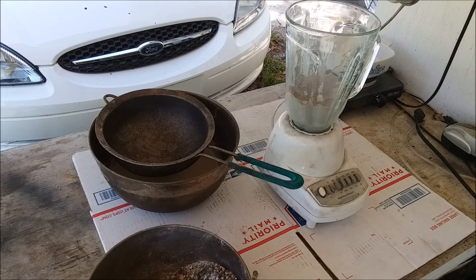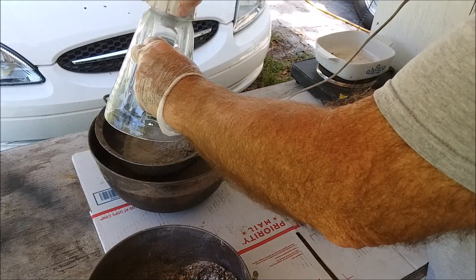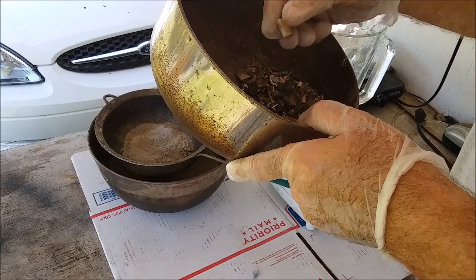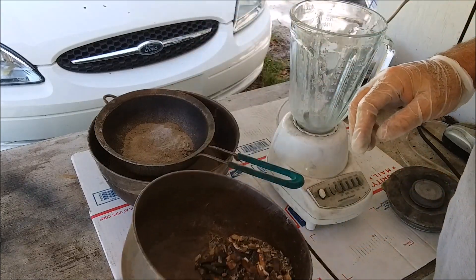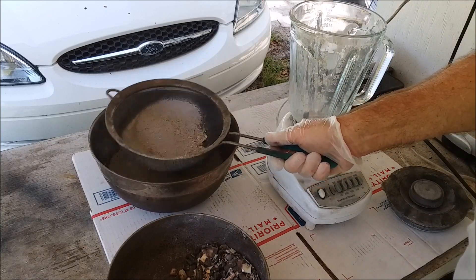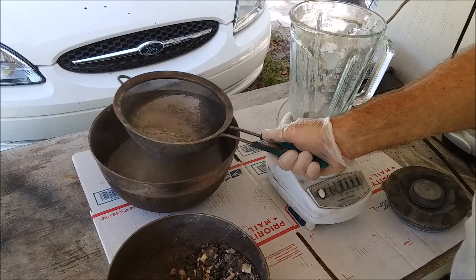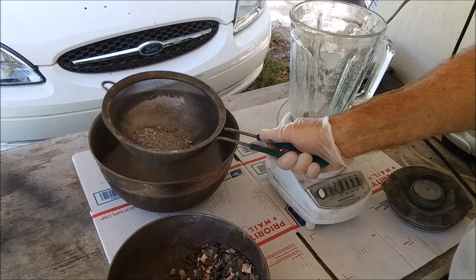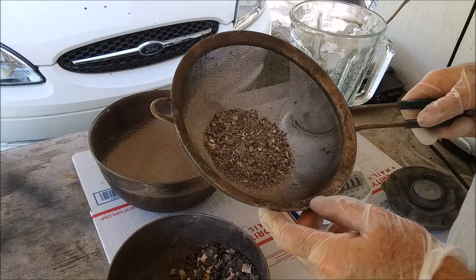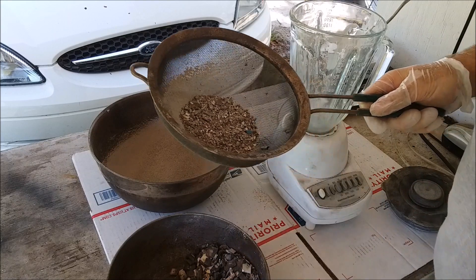Probably don't want to breathe that dust. Some chips you will find have a surprising amount of metal inside them. These chips I'm dealing with here have had all their legs dissolved off in AP solution for a couple of weeks, so there's no leg metal to deal with. But a lot of times these chips will have some sort of internal metal framework for the electrical connections, and some of them — those with heat sinks — have an internal framework to help conduct heat out to the heat sink. So some of these chips are going to have a fair amount of metal still inside them besides just the bond wires. Yeah, a lot of what this is is metal.